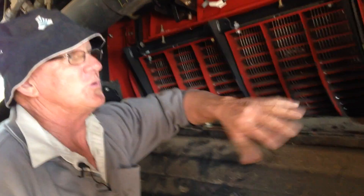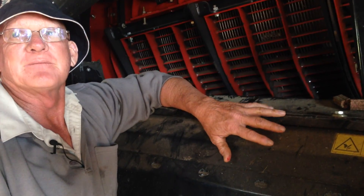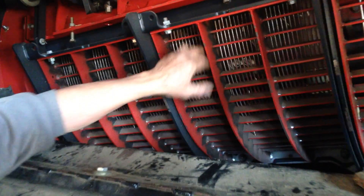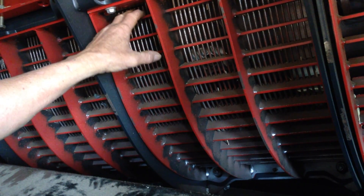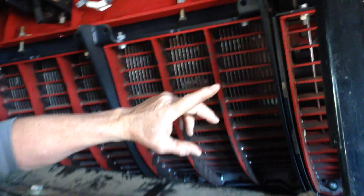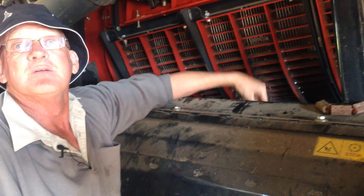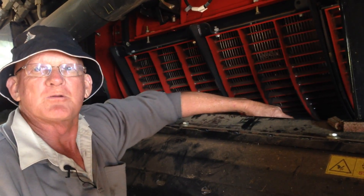Probably the most important with all the headers is to understand that you've got to get the grain and the weed seeds out of the rotor. I really am of the view that most of our modern headers are too blocked up. A lot of blokes take wires out of the second concave - that's a great idea, take every second wire out. But you need to get in your mind that it's screwing through the rotor and it's only in there five seconds, and you've got to get both the grain and the weed seeds on the sieves. Otherwise all the harvest weed seed management system won't work.